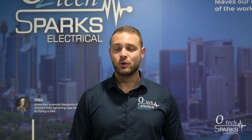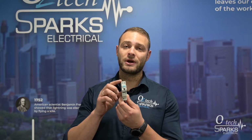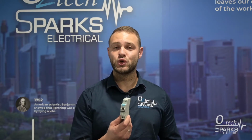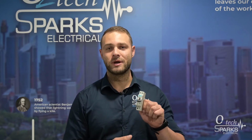When upgrading your switchboard, it is recommended that you use RCBOs, and they are RCDs and circuit breakers in one. So it ensures to protect your home from overload protection, short circuit protection, and earth leakage protection. An RCBO is the way to go.